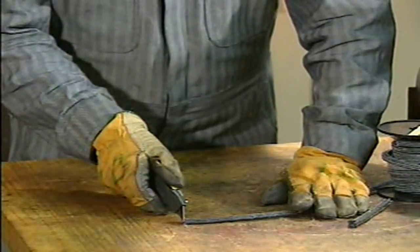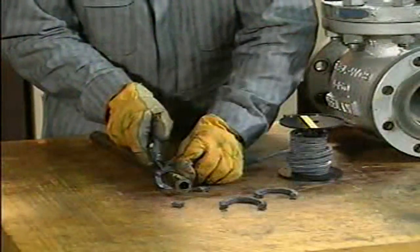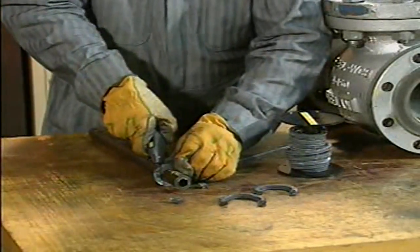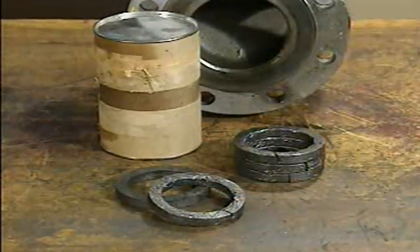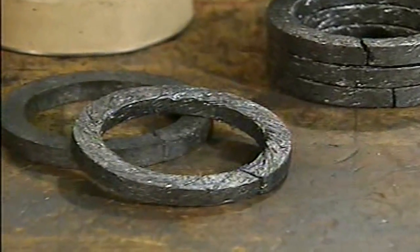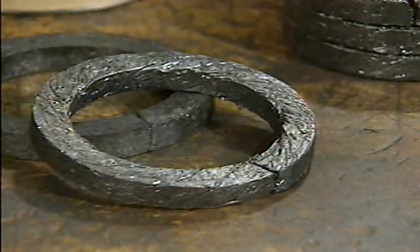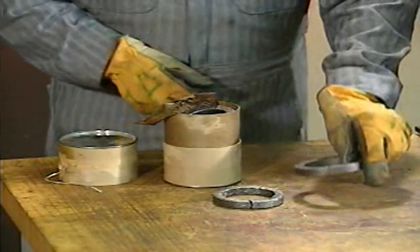This method is not always effective for larger valves with thick packing. Often a small v-groove is formed at the adjoining ends because the packing isn't curved when it's cut, and the v-groove would allow packing leakage. To avoid the v-groove problem on larger valves, wrap the packing around a mandrel and then cut it. Preformed packing is packaged in various pre-cut sizes, ready to fit into a stuffing box. If a valve requires packing to be arranged in a particular order, the pre-cut packing is typically packaged in that order.